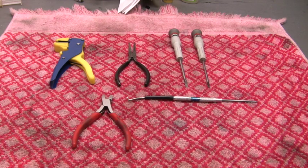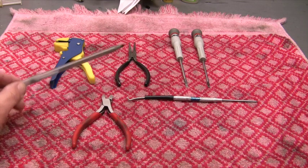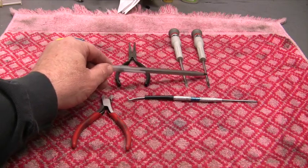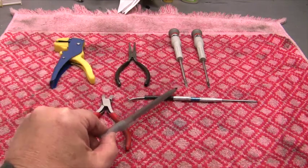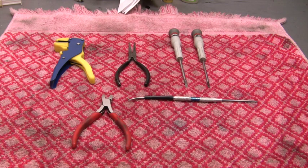One thing I've always liked about Electric Railway Company boards is how easy they are to install — there's no soldering, it's strictly done with very basic tools. You'll need wire strippers, wire cutters, needle nose pliers in some cases, and either a flathead or Phillips screwdriver. I also like to use a pointed probe — an old dental pick — for making sure wires going into plugs are fully seated, which prevents a lot of problems when you try to start it up.